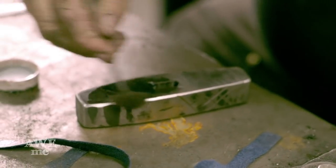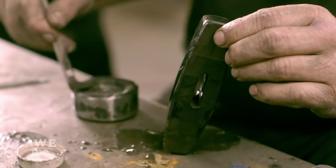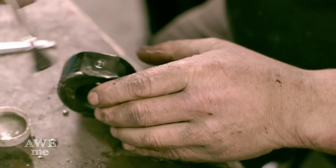I'm putting the blade into an electric heat treating furnace and quenching it in quenching oil to harden the steel. I want to give a black patina to the hilt and pommel, so I'm using a chemical that causes the steel to oxidize to a black color.